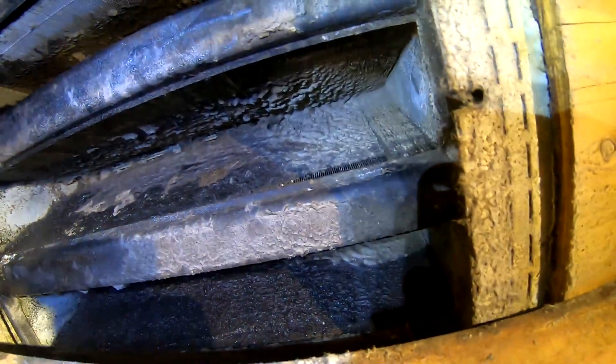Then I take a look up here — they say they cleaned the coil, but I could have done my leak search down here. They say they cleaned the coil. What kind of coil cleaning is that? That's bad. That very well may be the reason why we got low pressure. Look at that — I don't know if y'all can see that good, but you can't get no airflow with this.